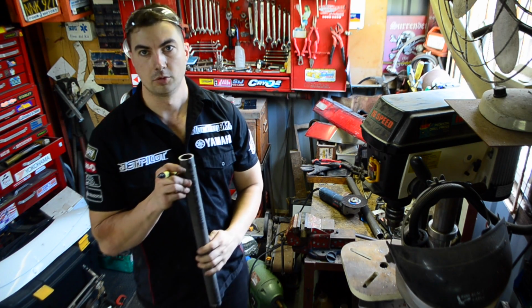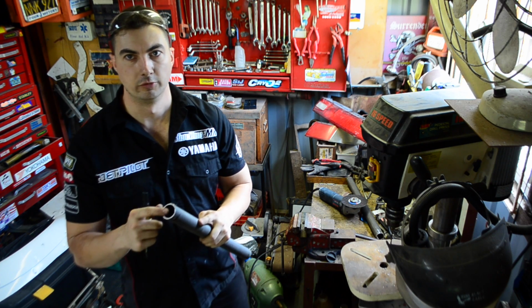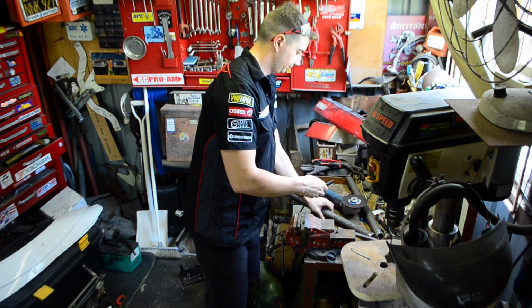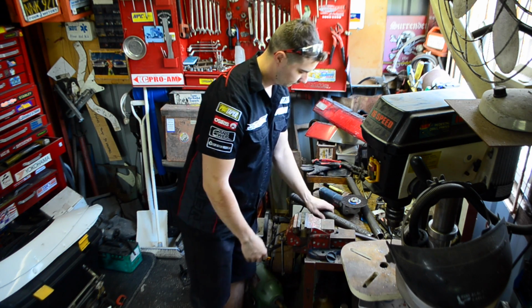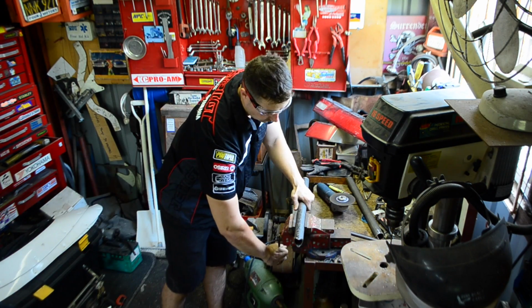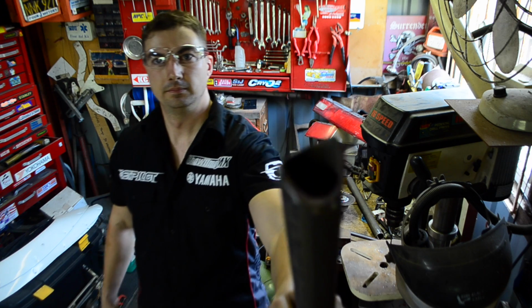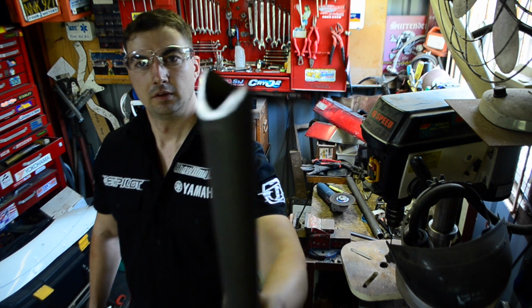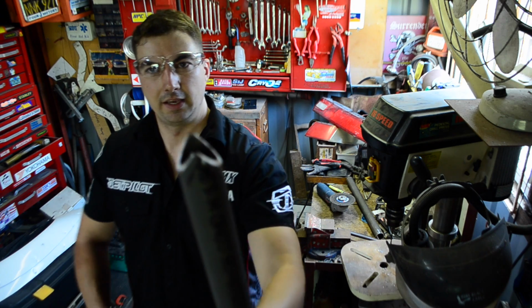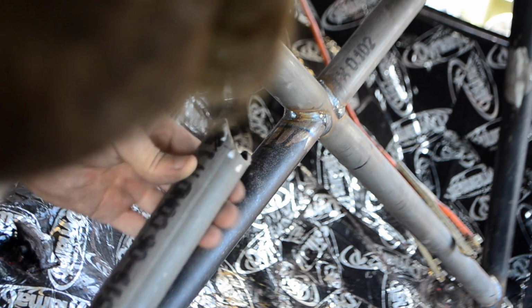Right, first job will be to cut the V. We'll mark out the notch, cut the corners for the notch, and then we'll round it out. And there's your first part. Give it a quick test fit, and then we'll see how much we have to take out of the throat. It's not too bad actually, so we'll just take it back a little bit more through here, both sides, and we'll keep this the same, and then we'll test it again.